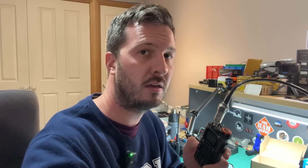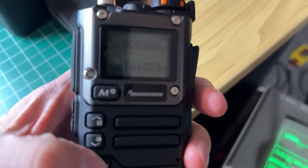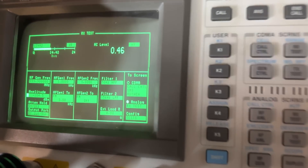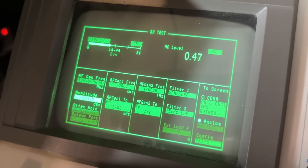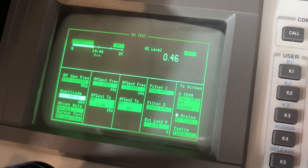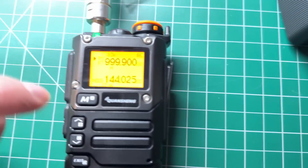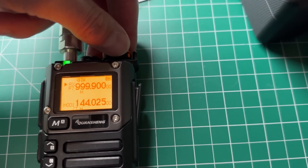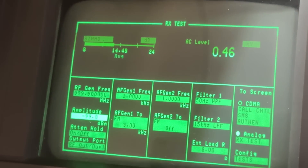So what I've done is I've done the firmware hack for the Quansheng — it loaded on fine. This does the frequencies from 13 megahertz all the way up to over 1300 megahertz. So let's just see how well it actually receives, because I didn't do that test with the old radio. I've set it to 999.9 megahertz. Outputting minus 104 dBm and we don't hear anything, but it just opens up the squelch there with the squelch set to 1. So it does receive, but it's a bit deaf — it's not really receiving all that well up at that frequency.